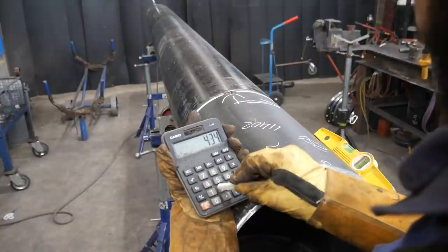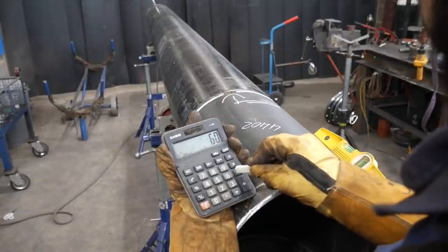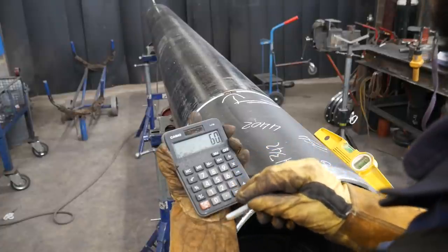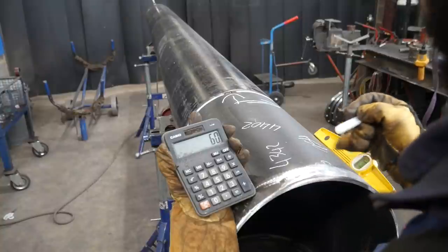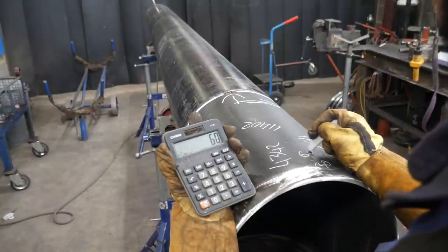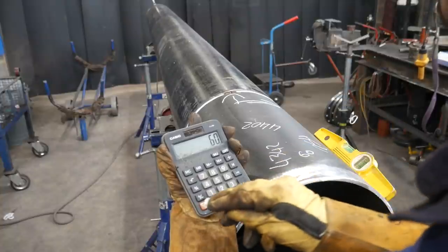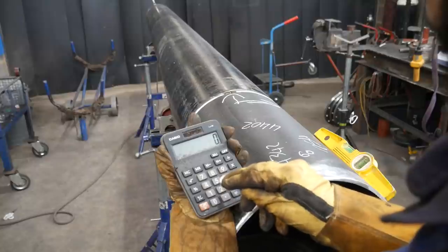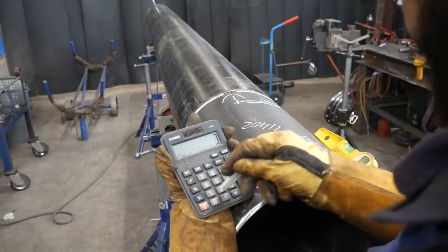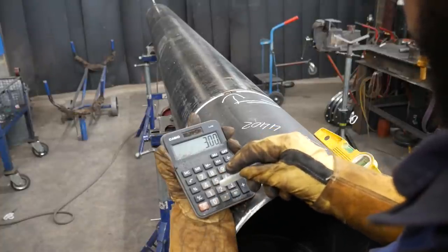So now I've had to slow down the video so I can explain what's happening. I've measured the overall, I've taken it away from what the overall of the pipe has to be, which leaves me 60 mil. But I know on the drawing the T has a flange going straight onto this side here, you see me standing, and that is a measurement of 300 mil. So if I do 300 mil, I think I should be typing it now, 300 mil minus the 254, which gives me the center of the T, it leaves me 46 mil.